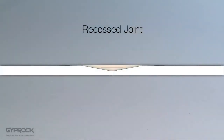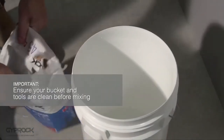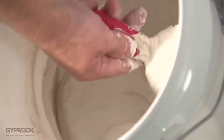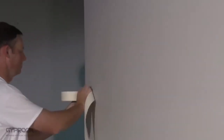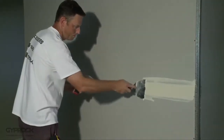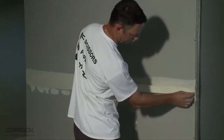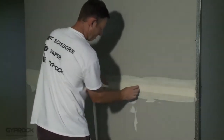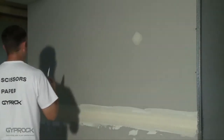First let's look at recess joints. If you're using a dry base coat mix it according to the instructions on the pack to a creamy consistency. Make sure you don't use a steel broad knife as this can scrape the inside of the bucket leaving small bits of plastic in the mix that can make score marks in your joint. Start by measuring out the length of Gyprock perforated paper tape you'll need for the joint, then fill the recess fully with the first coat of base coat or all-purpose compound using a 150 mm broad knife. Bed the paper reinforcing tape into the center of the joint and cover lightly with additional compound, ensuring the tape's natural center crease points towards the joint.